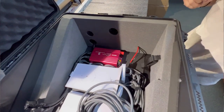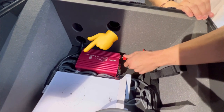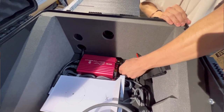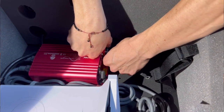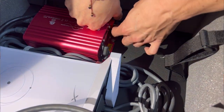For 12 volt use, take the power cables from your base and your router and connect them to the top of the inverter. The external 12 volt DC port is ready to be screwed onto the inverter. Remove the red and black knobs on the inverter and attach the red wire to the red side. Then attach the black wire to the black side and make sure to secure the red and black plastic nuts securely.